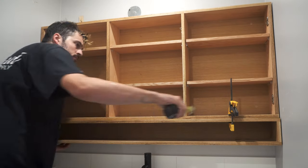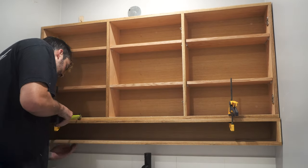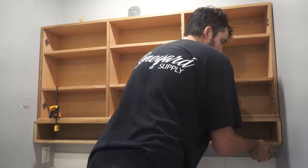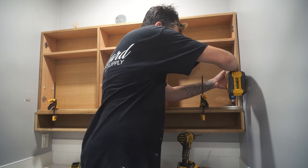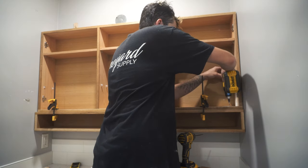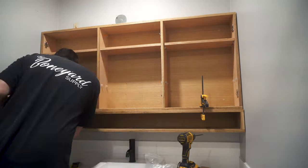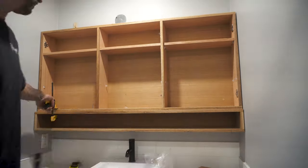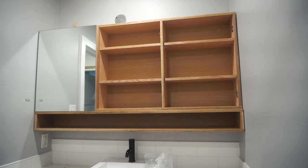I adjusted the lower cabinet so it sits exactly 1 inch in front of the top cabinet. This is to allow for the 3/4 inch door, the 1/8 inch gap, and the 1/8 inch glass. I then screwed the bottom section to the top cabinet, covering any screw holes with fast caps. I then hung and adjusted all three of the glass doors.